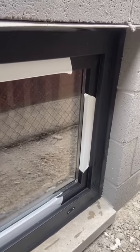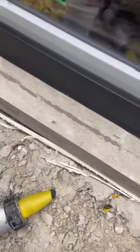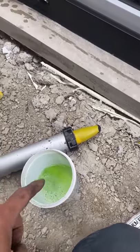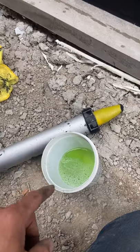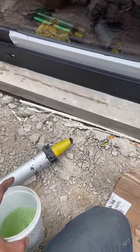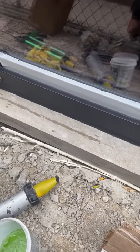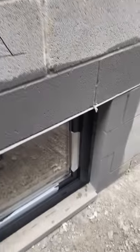It's hard to do a nice bead of caulking when you have a one-inch or three-quarter-inch gap to fill. For the soap solution I use dish soap at a heavy concentration — about 60% water and 40% dish soap. That way it's easy to tool the silicone and it's not very sticky to your fingers. The bead of caulking should look like this around the windows, and the builder and homeowners will be happy.